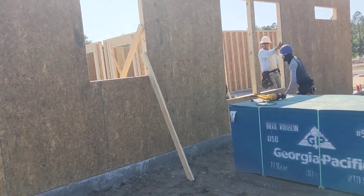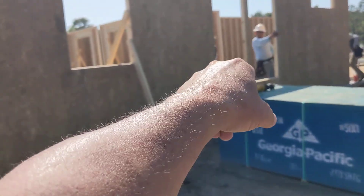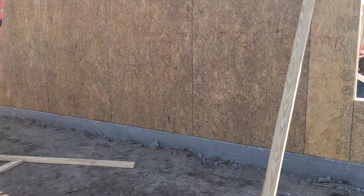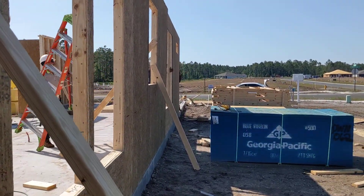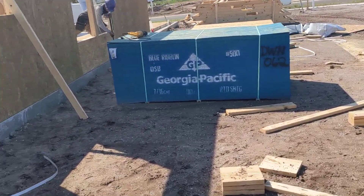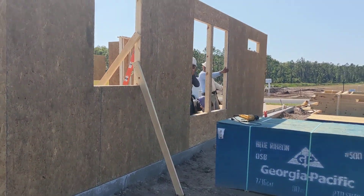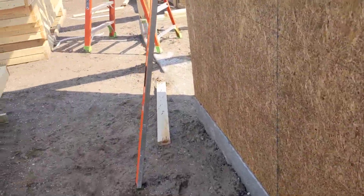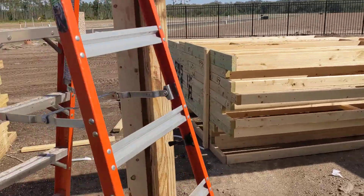This is just temporary, but I like to be right here with the guys. I've got it written over here — out of plumb from this point. Just talked with their supervisor and said, hey, we're out of plumb about half an inch over eight feet. It's not bad, but we can do better. These panels are manufactured in a controlled facility and they're trying to get them all plumb — they temporarily set them up. So I've got my big eight-foot level and my string line, walking around making marks around the build.